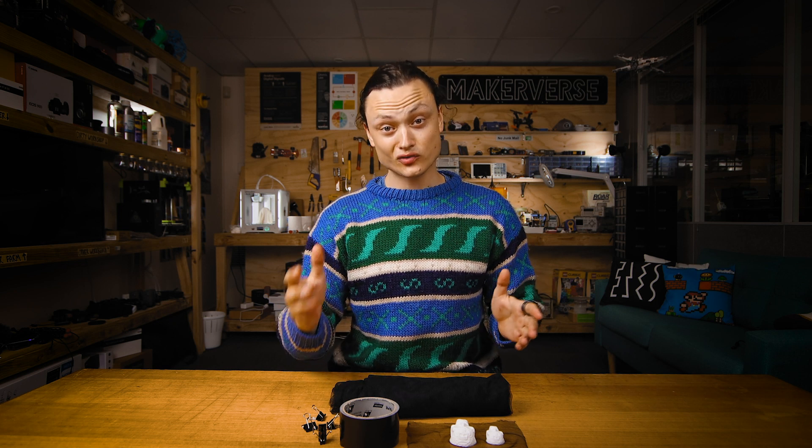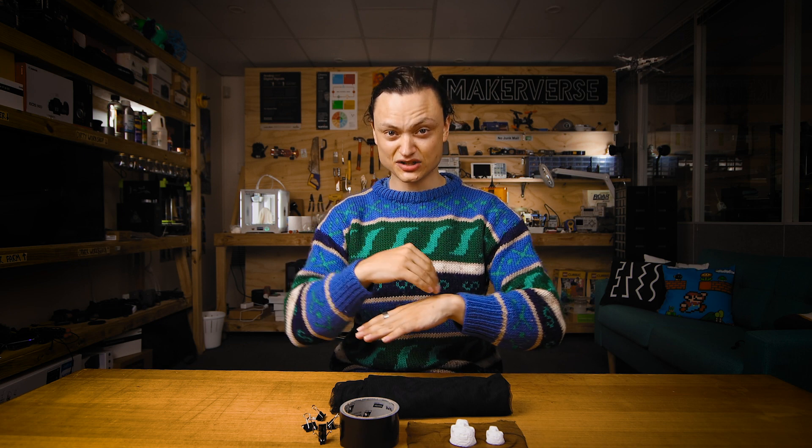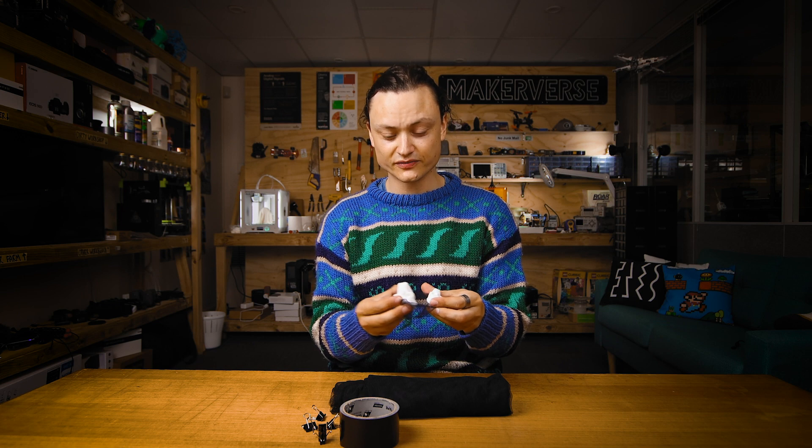Once the nozzles are reheated, the printer will continue to print as normal. The Tulle fabric that I've used has a lot of holes so many of the printed material ends up joining just like normal, and any of the extrusion that hits the fabric will embed itself into that material. The connection is remarkably strong and sturdy — much better than super gluing the components onto fabric.